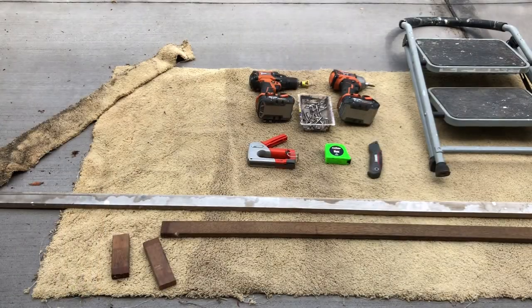Here's pretty well everything you're going to need for the job. Most importantly, you want a piece of carpet — and this is where it's make or break as to whether it's going to be free or you'll need to go buy something. If you're fortunate, you'll have an old roll of carpet laying around that you can cut up. It's excellent because it's a sound-deadening material, it will exclude dust, it will conform to the garage door as it rolls up and down, it's easy to fix, and it's quite solid and hardy.